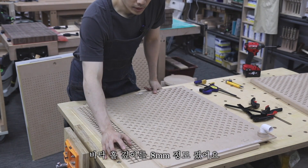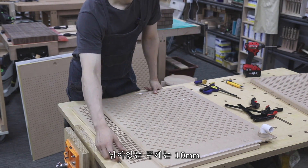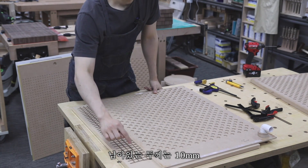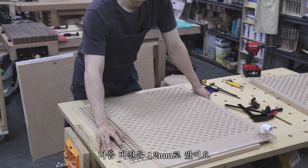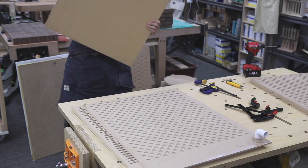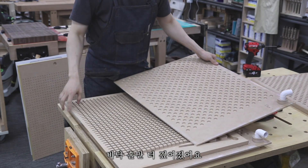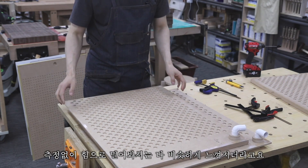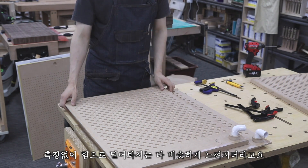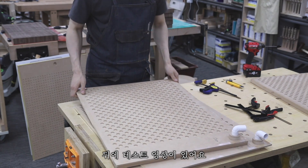The base floor channel depth is 8mm, with 10mm of MDF remaining. I then tested a deeper version at 12mm. That version is otherwise identical — only the channel depth increased. When testing by feel without instruments, both versions felt about the same, so I ran a proper pressure test, shown later in the video.